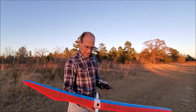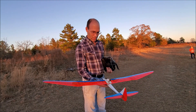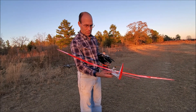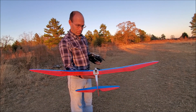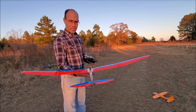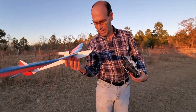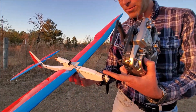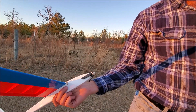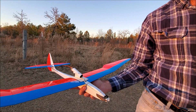For those wondering exactly what the setup is, this is an Aerotech 18mm reload — an Aerotech 18-20 casing with a C3.2 load in it. I get those mixed up as there's a C and a D reload. We're running a T-motor — it's an F-1303 5000 kV on a 4.5 inch prop, which we'll be carrying that specific size in the store soon because I think the smaller props are a little better on these.